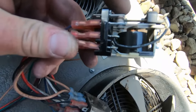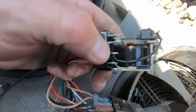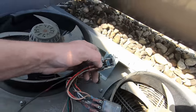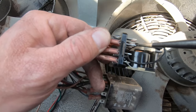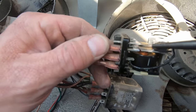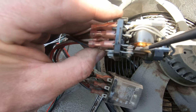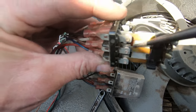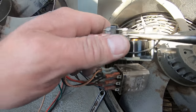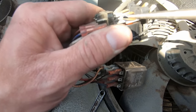They should be up at the top contact. I took the cover off and what I found is this relay is welded closed - at least two of the three. I'm trying to pull up on that - it's welded. This one can move - the center one - and this one over here, there it is, I just broke it free.